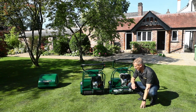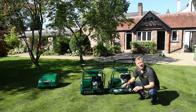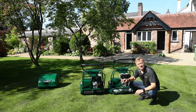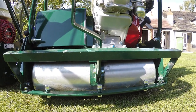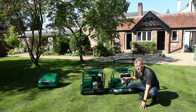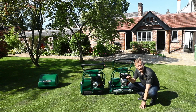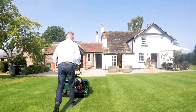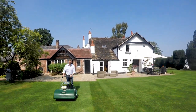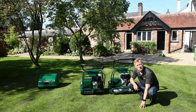Next, let's look at the rear roller, because these are quite different too. The rear roller is so important on these cylinder mowers — they control the height of cut, they drive the mower along, and of course they create the stripes. Both systems have a pawl and ratchet differential system, and both rollers are split into two. This allows us to correct direction slightly without the drive affecting that, and when turning at the end it prevents great scuffing which would wear the grass — with the differential, both roller halves can drive at their own speed.